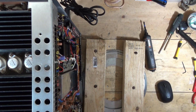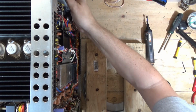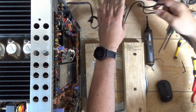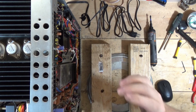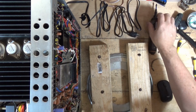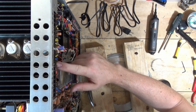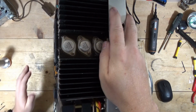Alright, so unfortunately the jumpers are on the bottom of this, so there's not going to be a really good view of this with the camera. But I need to connect, first I'm doing the audio adjustment, and I'm going to have to do this on both sides, so I'm not going to film the entire thing. Jumpers are here on the bottom. I need to set, let's see, the positive to J13, negative to J24. Those are on the bottom. And adjust the trimming resistor R766 until it reads 10 millivolts.